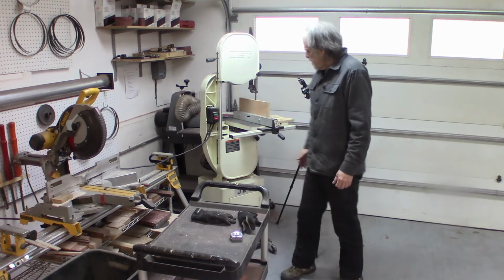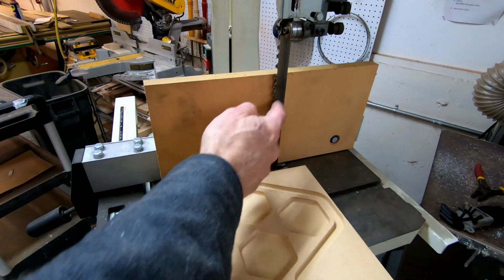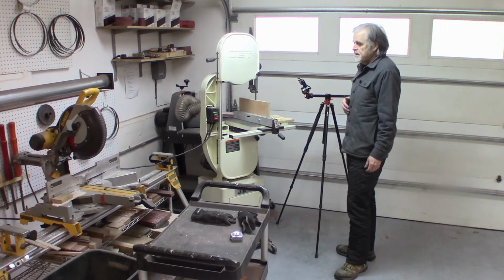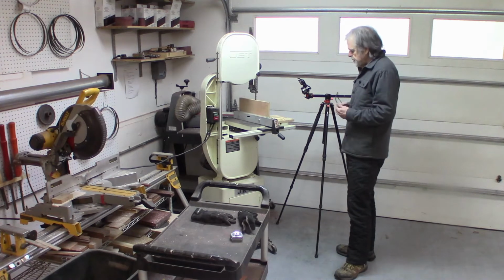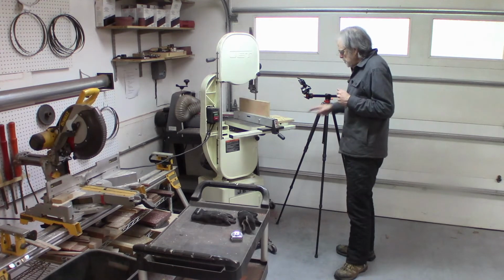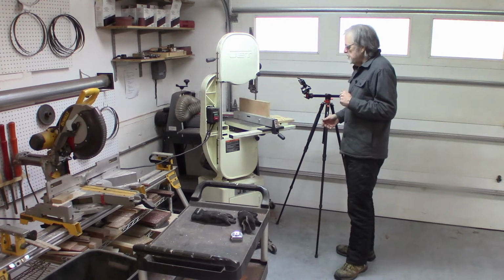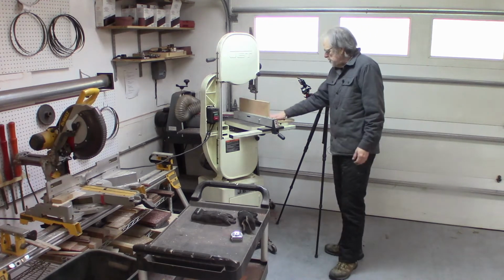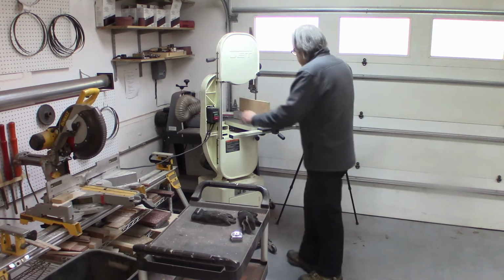So I'm out at the woodworking side of the shop, and I've got the bandsaw set up now. I'm using a 3/4 inch carbide tipped blade with an accessory fence. I actually make my own veneer out of hardwood sometimes when I'm doing veneering, and this blade kind of keeps itself under control and doesn't wander and produces a pretty nice cut. So now I'm going to section the test piece, and then of course when I get the actual hardwood piece made that will be glued to MDF, I'm going to use the same trick to remove it from the support stock.